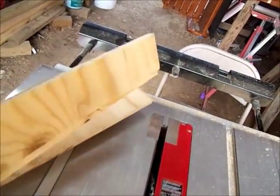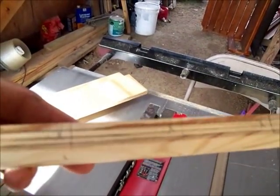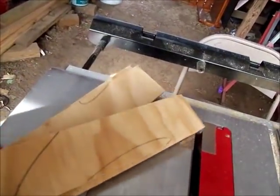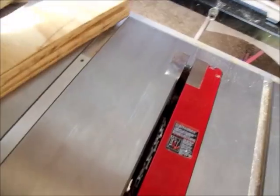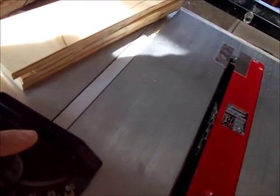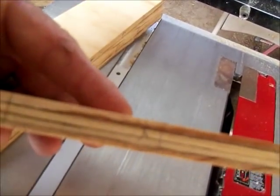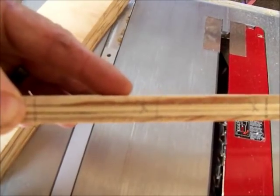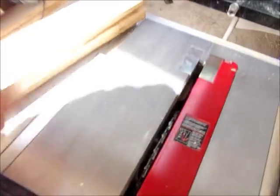Okay, guys, I got all my panels marked up for my dados for my quarter inch board for dividers. Every one of them marked out. My dado stack will accommodate my blade in here. I'm gonna use the miter gauge, slide it through, knock out on the side of the X. Quarter inch dado by a quarter inch deep. Alrighty guys.